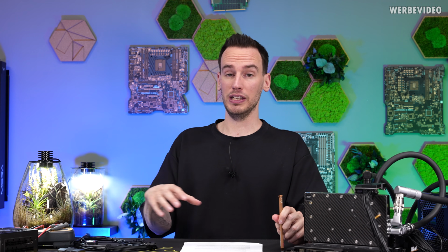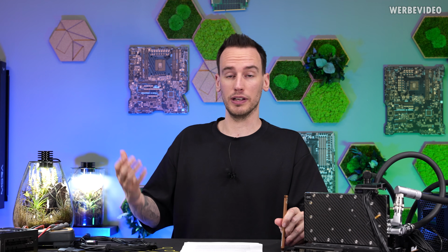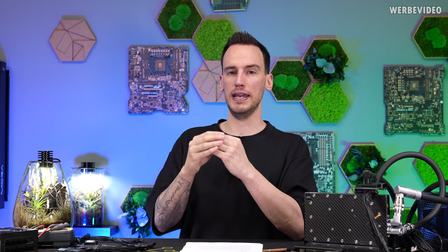That's just pure speculation. All that I could see in this case is, in the state that it arrived and when I measured the resistances, we have very uneven resistances, causing definitely uneven current distribution, and we know that something went wrong here. If you overall have a higher contact resistance for the entire connector, it also means that you have more heat being generated. And with a calculated 4.6 watts, that is already substantial for a connector. And the contact patch where the connectors are mating is a very tiny surface, and locally that can definitely generate quite some heat.